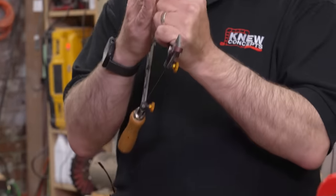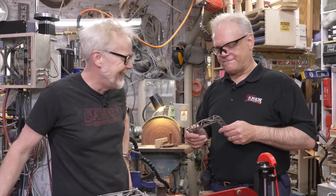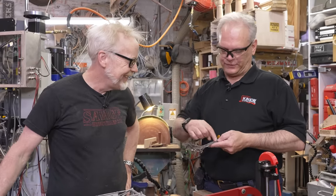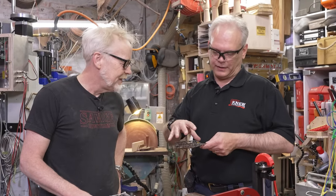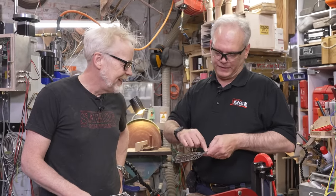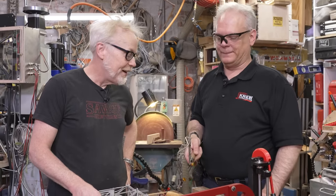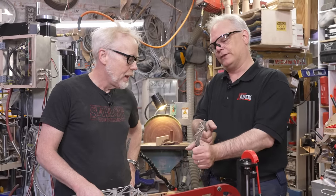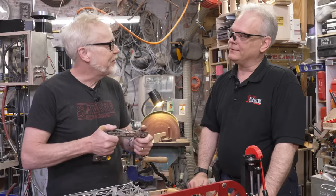When I was designing the pieced part version of this, I had a version that was all flat. It was great in tension and it was absolute spaghetti in torsion. I finally got frustrated one night and said, I've got a little teeny TIG at home that fires through a microscope. This is actually the test legs from the spaghetti monster. I finally just got frustrated, tigged it here and here, took a pair of pliers, peeled it open, and zigzagged some titanium struts in there. I took it in the next day to Lee and said, twist this. And it just doesn't. That must have been very satisfying. Oh boy, was it.